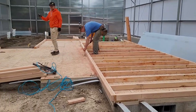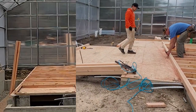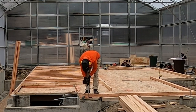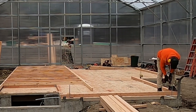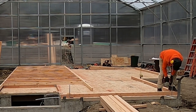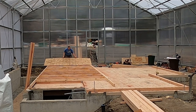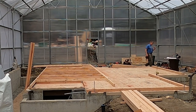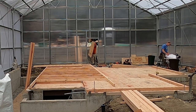Back on site, Mike and Nate first framed the long north wall. More drilling for more tie-down bolts. Pool to the left is a 4-foot drop. The entry to the crawl space in the foreground is another 4-foot drop to avoid. Otherwise, this is a rectangle without any windows, so framing and sheathing moved quickly.